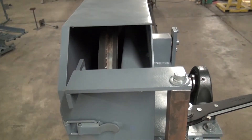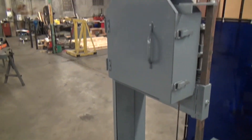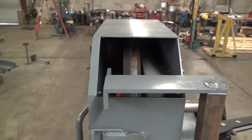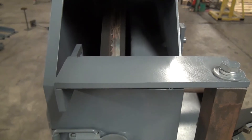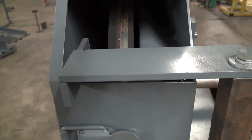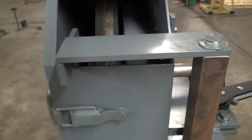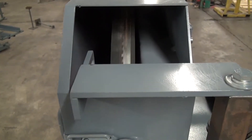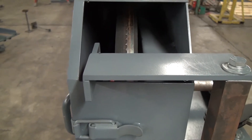I've got the camera looking down on the saw now, and you can see this is where we just were. Looking down on the wheel, you can see that the blade is not in the center. Because the blade is to the back of the saw, our blade is going to want to wander to the right side while we're cutting. So we want to move the blade to the left or toward the front of the saw.